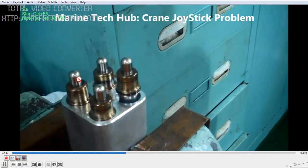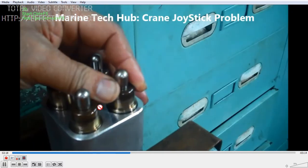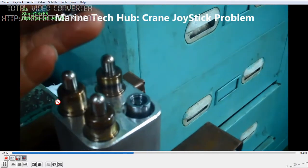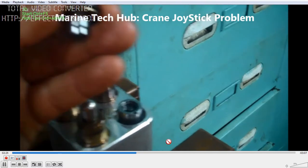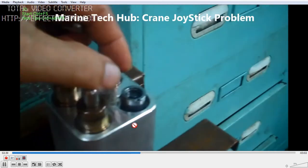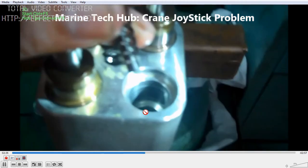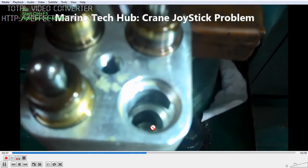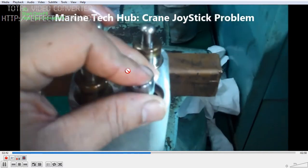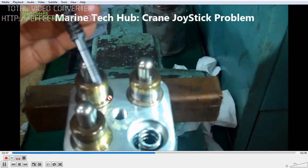In this case we are using only 2 of the units. This one is for hoisting up and hoisting down - the other spool is not used. We had a leakage here. There is a big spring and a small spring, and this spool will move inside. There are 4 of them but only 2 we are using - the other 2 are not used in our case.